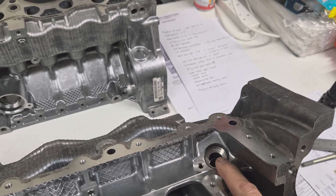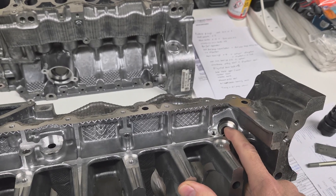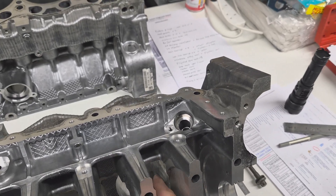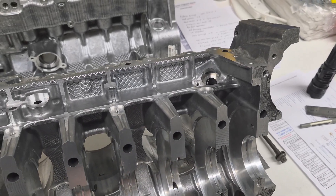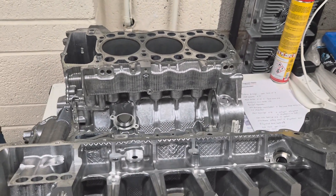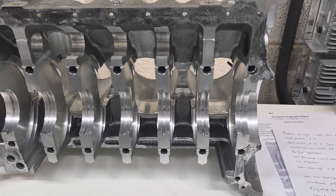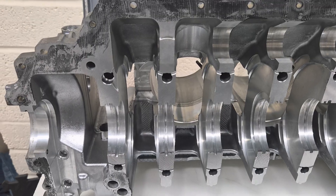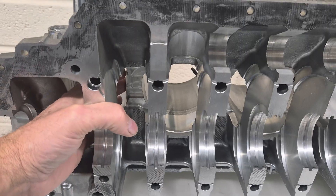We have oodles of oil being pumped through there at up to 60 pounds per square inch, flowing down here. This is oil that's been picked up freshly, so it's obviously going to be cooler from the oil pan, and it's feeding the entire engine with a gallery coming up here, feeding through all these holes into the main bearings and other channels up to the heads. On this opposing cylinder crankcase you can see there's no additional material — there's a gap here on the last one.